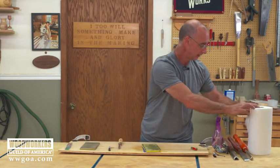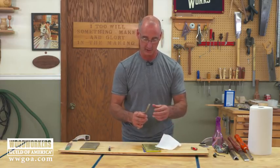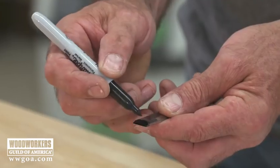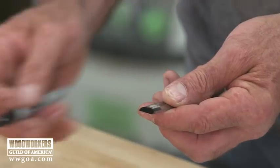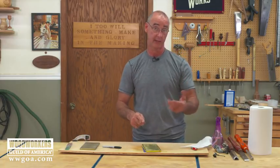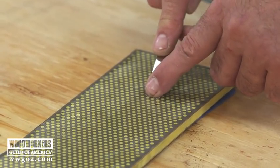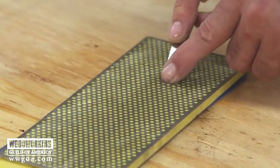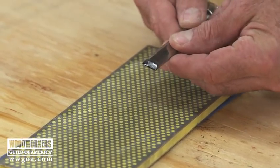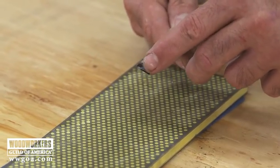If you're a little unsure whether you're maintaining the angle — bench chisels are generally sharpened at either 25 degrees or 30 degrees — here's another alternative approach. Take a felt tip and color in the bevel. Let it dry for a second. Now we're going to test our work: touch, puddle, feel it go flat, stroke. Are we hitting the whole bevel? Is all of the felt tip coming off? If you were only on the heel or only on the tip, you could see that.